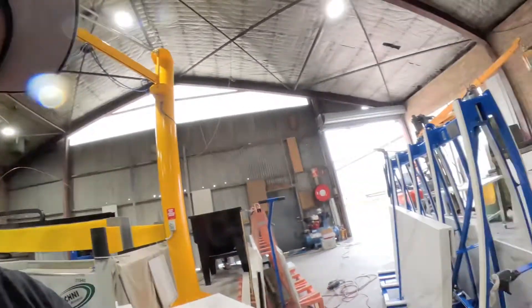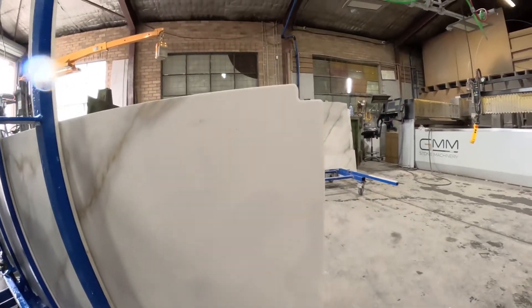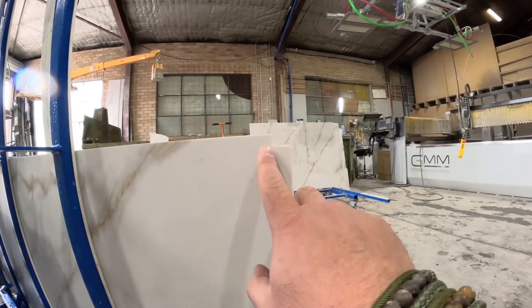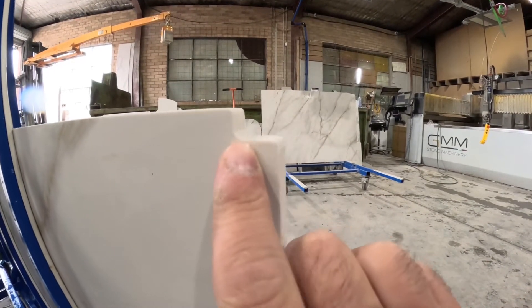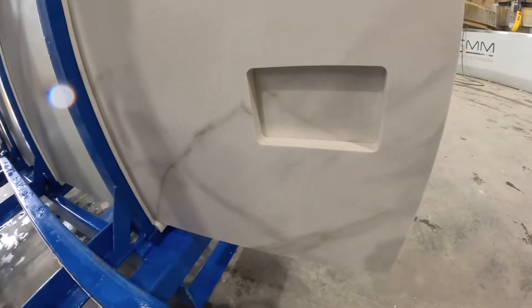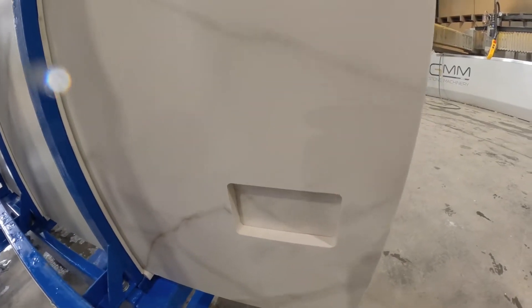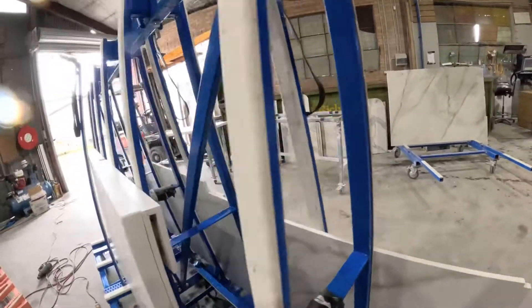And while we love water jet, we can't do this with any other system. Have a look at this. We've got this job on the A-frame at the moment. This is the splashback, where there's an 18mm panel that sits there. And you can see there's a 3mm radius right up the top, there's a 3mm internal radius, finishing it off with another 3mm radius there as well. Power points are all cut out, done beautifully with 5mm radiuses. You can't do that with blades. And we can do these beautiful cutouts, beautiful radiuses, on all the pieces, on all the splashbacks.